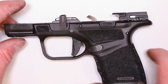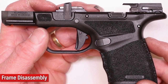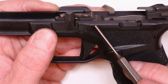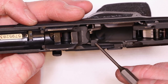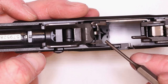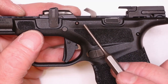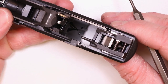Now let's move on to the frame and install our lighter sear spring. Let's take a close look at the frame before we start ripping it apart. You've got your disassembly lever here, your trigger pin here, your locking block pin here — that's what holds your locking block in place. You've got your slide stop and your slide stop spring. Take notice of how it's sitting on top of that little piece on the slide stop. And then your sear housing right here. This is your sear housing pin. Sear housing pin, locking block pin, trigger pin. Sear housing back here.